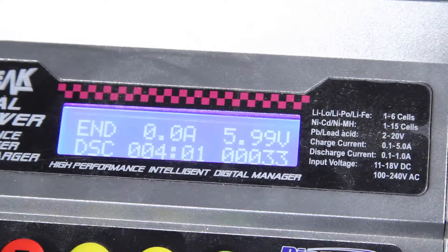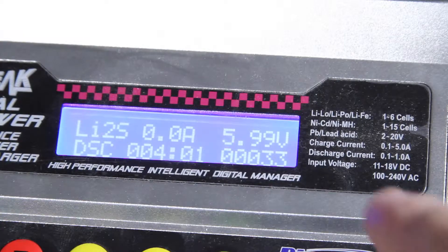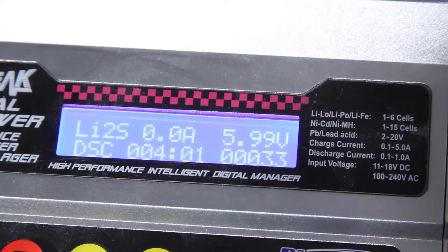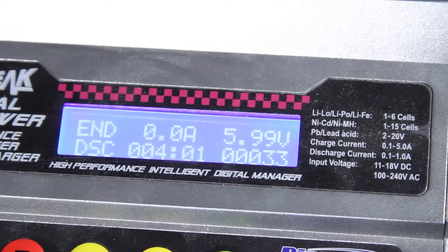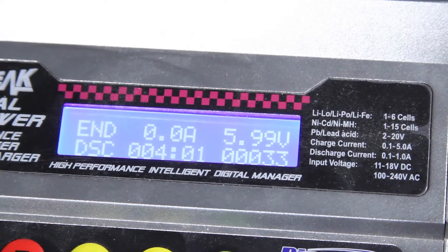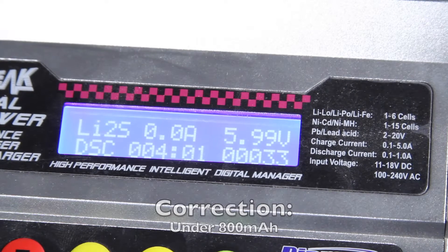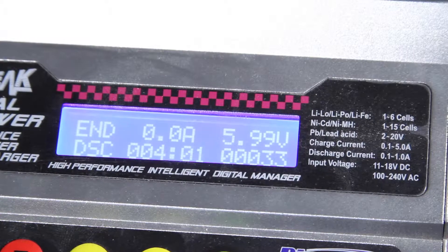So that's pretty much it. As I mentioned, we had just under a thousand and then it cut off, so we started it back up and got another 33. Basically, the Canon battery held just over a thousand milliamp hours, the Wasabi Power batteries held a little over 800 milliamp hours, and then the no-name ones were horrible at around 500 milliamp hours.